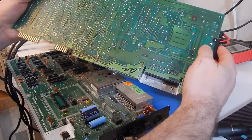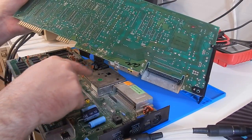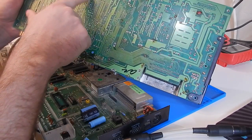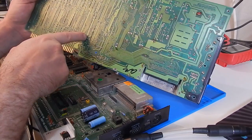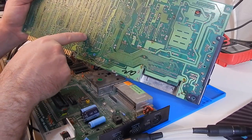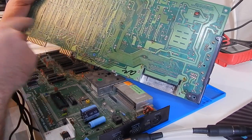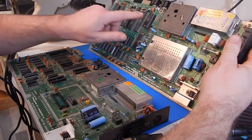As we can see here, there's been some stuff done around here, around the serial and the AV connector. A bit of work done here, here, here. In fact, there is a broken pin there. Oh, well, sorry. What I should say is the pin is there, but the pad has been completely ripped off. And that's on the PLA.